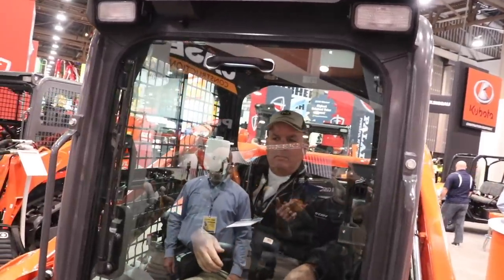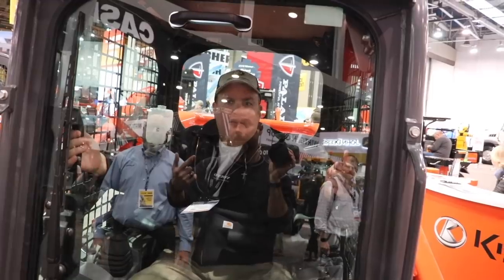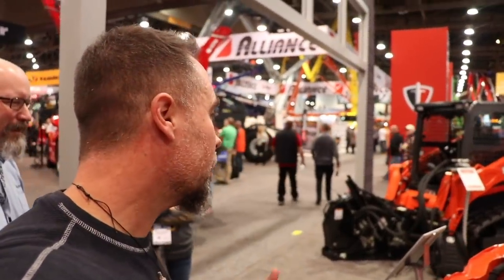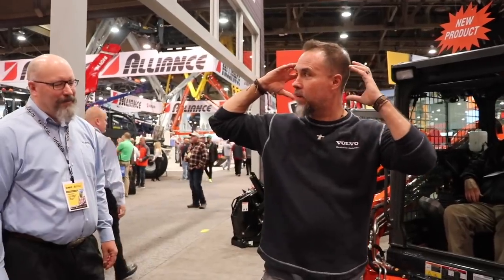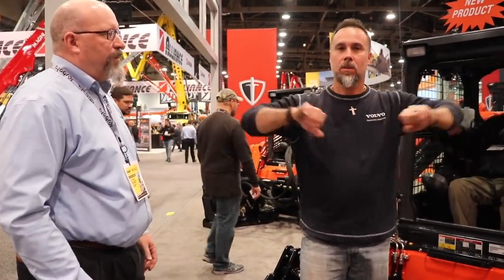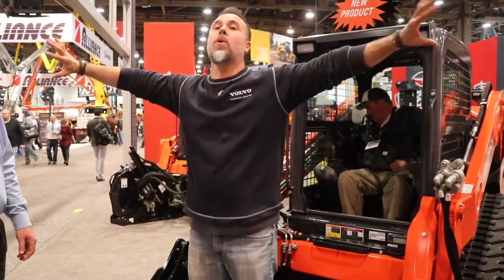So now as you're in there, did you notice that we sound a lot different? Yeah, so it's a lot quieter in there, isn't it? So one of the things I noticed as soon as I crawled in that cab, you guys, was it's almost like it reduces the decibels probably by 15, maybe 20, right? Because I put on those noise reducing headphones and I'm like, shink. And that's what that cab kind of felt like. Did you do anything with that cab to do that? The cab is sealed and pressurized. So it will reduce, positive pressure. So you're blowing your dust out? Yes. Okay, so that's important. So what I mean here, guys, if that's a sealed pressurized cab, when you seal it and then you put positive pressure on it, instead of it collecting dust inside, it's continually blowing the dust out of the cab.